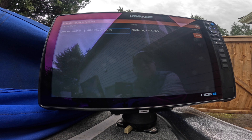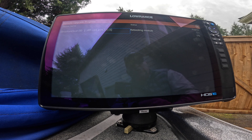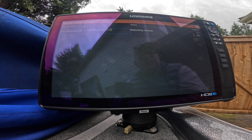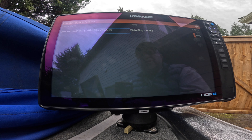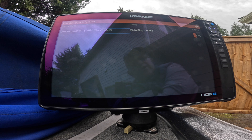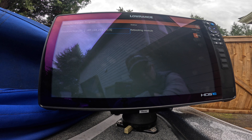We're transferring all the data, and it's extracting it from the download. Don't go by the 100% at the moment, because it's got to go through and reboot the module before it's completely installed. Now you see the progress is showing you on the right for the installation. It's very important to download the same version of software on each of your units, because if you have different versions of software, it confuses the units when they try to communicate through the ethernet cables, and you could end up with all kinds of bugs — things aren't working right, maps aren't sharing properly, waypoints aren't sharing properly, you can't see the right sonar transducer.